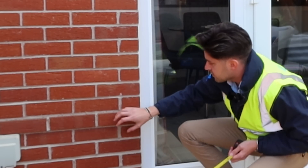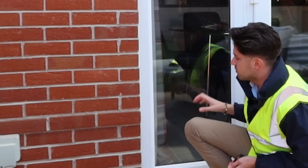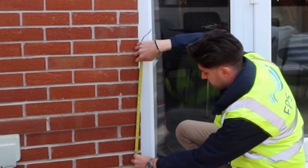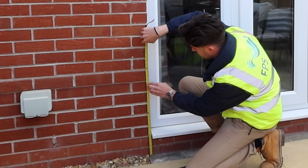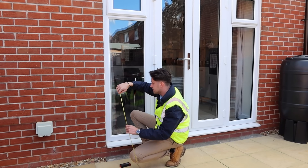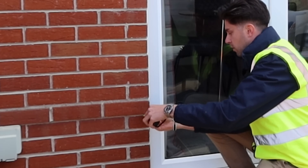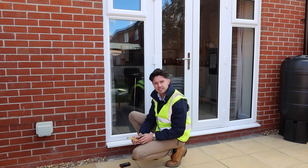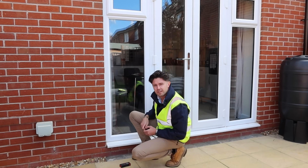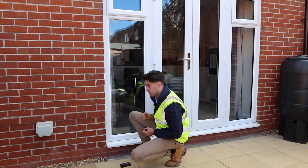In this instance we've got brickwork that actually sticks out, so when I'm recording measurements about the doorway I'm going to make a note of that. The height that it sticks up from the floor is 520 millimeters, and I'm also going to record how far it protrudes from the wall, which is 10 millimeters, because it might have an impact on how a barrier is to be installed. We want to get all of the measurements in one go.